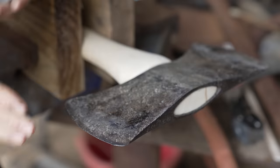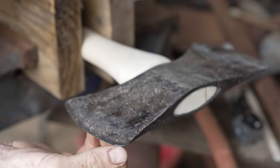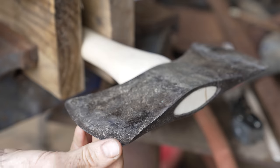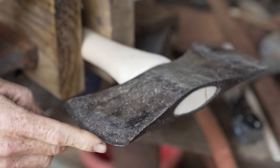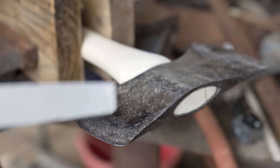If you see right here, the sweep of this cutting edge changes a little bit. It looks like this got kind of broken off or nicked off right there — maybe somebody hit a piece of concrete — so we're going to have to work on that a little bit and blend that back into this edge here.